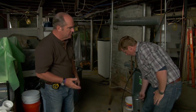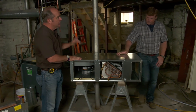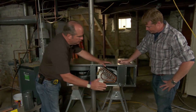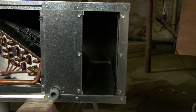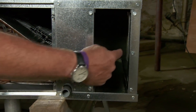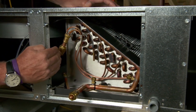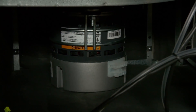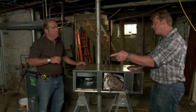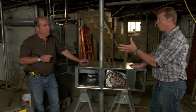So the question is how do we zone this system across three different floors? We're going to use one air handler on each floor. Air is drawn in, passes a hot water heating coil for heat in winter, then across another coil for air conditioning in summer. There's also a very smart blower that lets us dial in the exact fan speed we want to make it really quiet. So instead of mechanical dampers for zoning, the answer is one air handler per floor — great control.